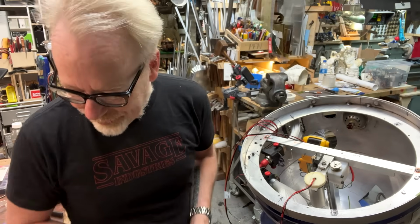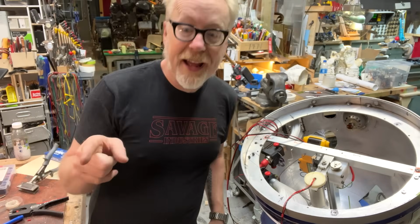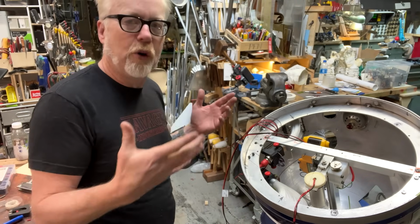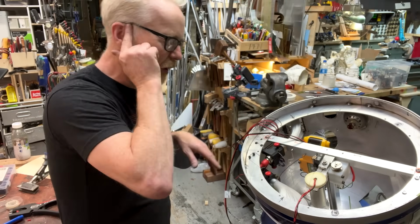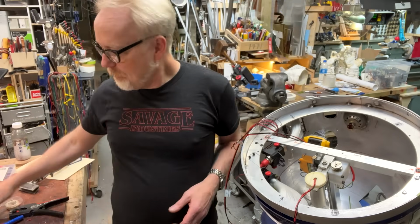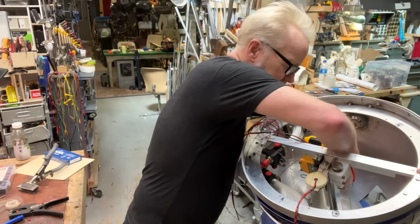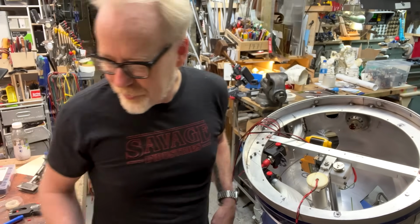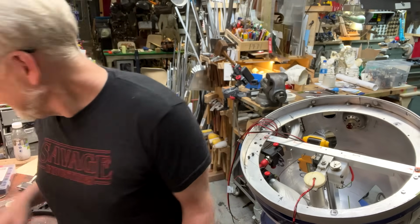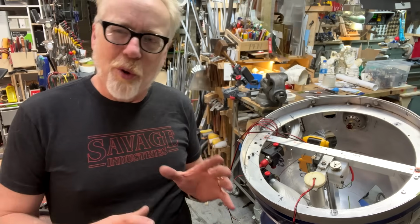I'm super happy about that. So then how do I step that 20 volt power down to a voltage that I can use, which is 12 volts? Most of the things in here are going to run on 12 volts, some of them on 3. I've got a little 3 volt transformer, but 12 volts. And I first had... Well, there's a thing in there. It's 12 volts, but it's like maybe an amp. And sometimes when these things tell you that they're like an amp or two, the answer is they're not quite.